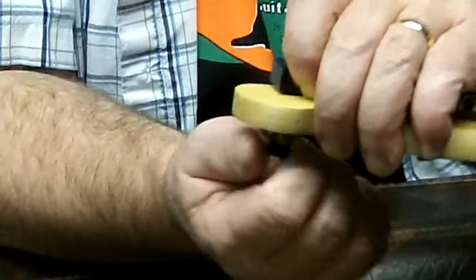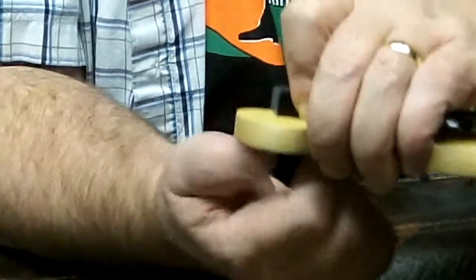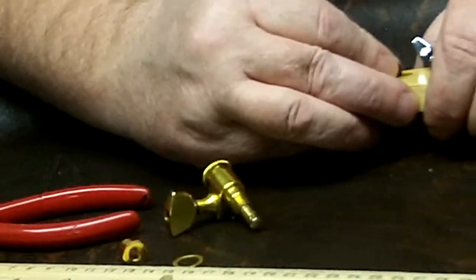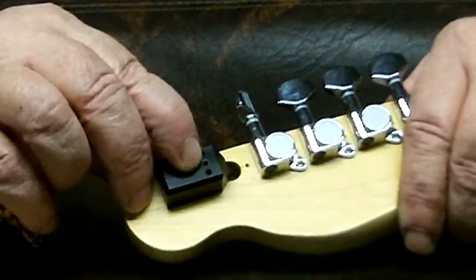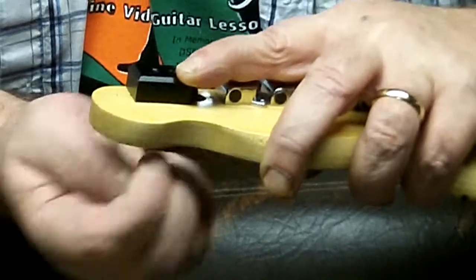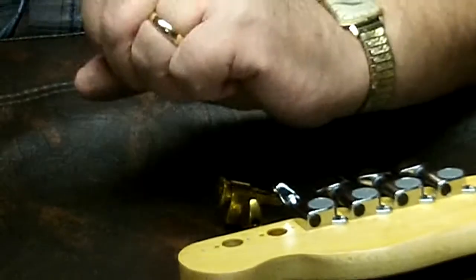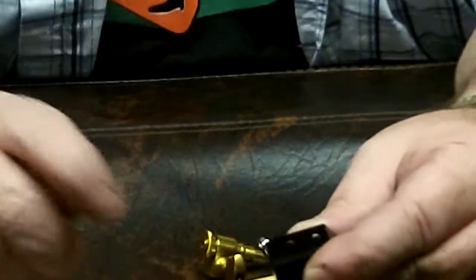And you just stick it on. It fits pretty much every headstock. And you center it up on the next hole. You've got to eyeball this. And then you drill the hole through one of the holes in this, it's a guide. I've used the thing a dozen times the last 3 or 4 years, and every one of them has always been in the same hole. Most of them are in that center hole. That's the guide. I don't know if you can see that or not. There's 4 holes in here for guides, but the center one's the main one.